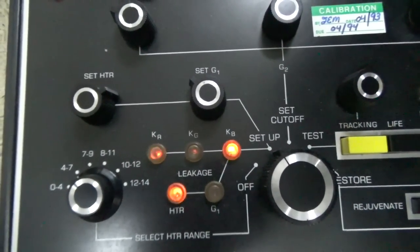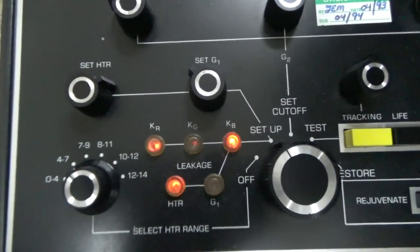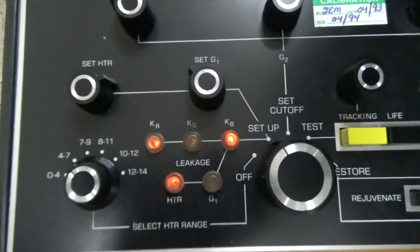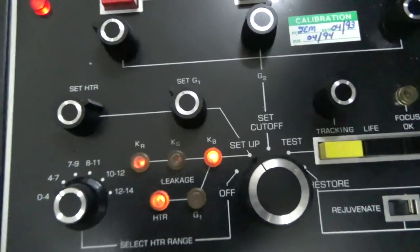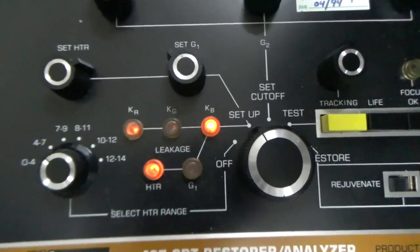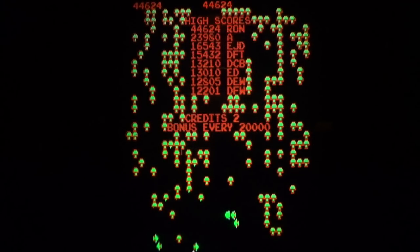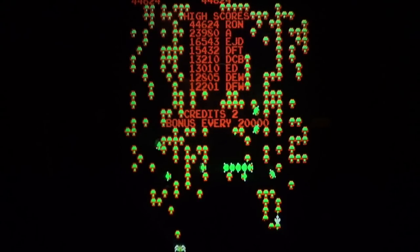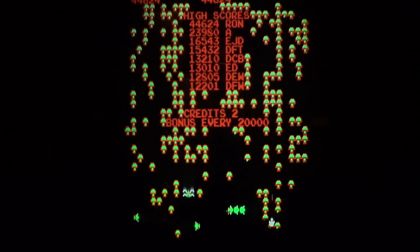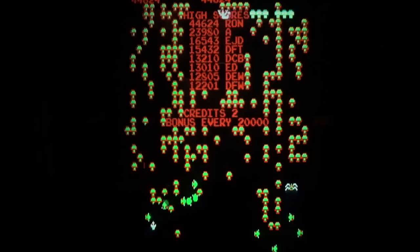Unfortunately, this is a small neck K7000 tube. You can get those out of vintage TVs like from the 70s and the early 80s. We've probably got one floating around here somewhere. So we'll swap another tube in and that should fix all of our color issues. All right, folks. So we have swapped out the tube with another tube that we had. We actually had one off of another monitor. This is not a TV tube. So it's got a little bit of burn-in, but you can't see it.